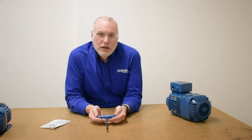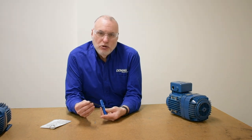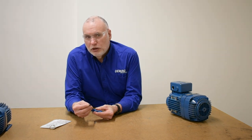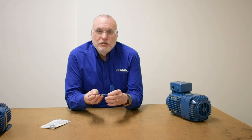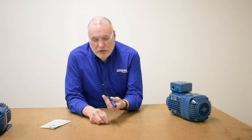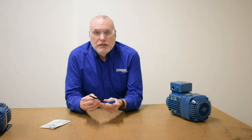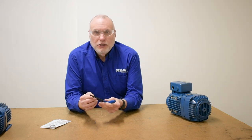I choose to use an Allen wrench — I like the T-handle variety because it lets me press very easily on the end of the wrench. I like the end that we push through that contacts the end of the motor shaft. Having the flat surface helps us push on the end of the steel motor shaft and make the displacement happen on the smaller motors. On the larger motors, it's safer to go through the hole and butt up against the rotating shaft when you have a flat surface on the end. I tend to avoid using screwdrivers for this, though some people could on a small motor. We additionally add O-rings. The O-rings will be pushed up to the back of the motor and then we'll let the spring kick the wrench back away from the end cap. The distance between the cap on the motor to the O-rings is the axial displacement.